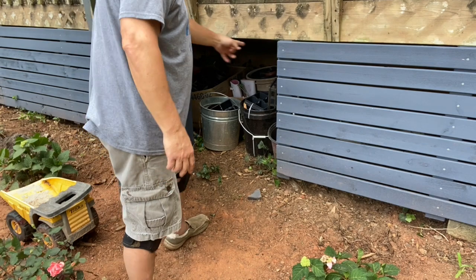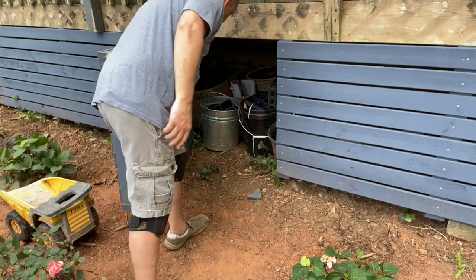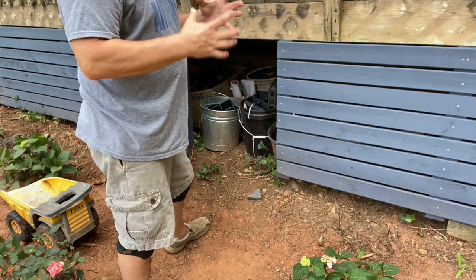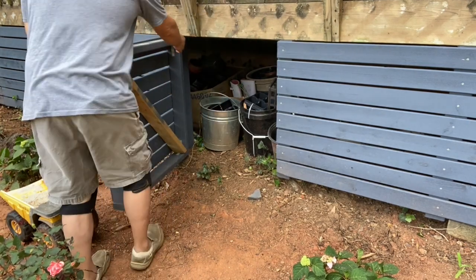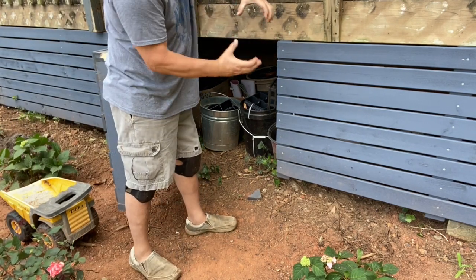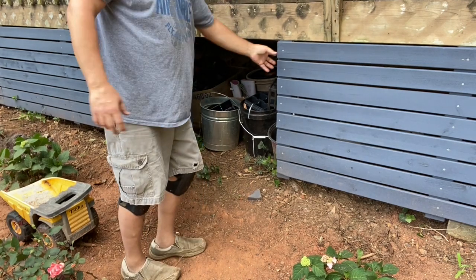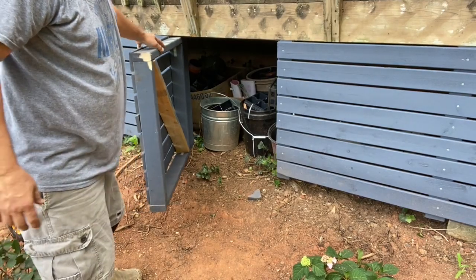So all I did there was I put a board here, a down board here, and then I had to put in a solid board back here, like a 6x6, I think, or maybe it was a 4x6. So back in here, I put a 4x6. There's a down board in front of it. So there's a down board at the same point this is, and then there's a 4x6 back behind it for me to screw to give me the stability to put a door on it.